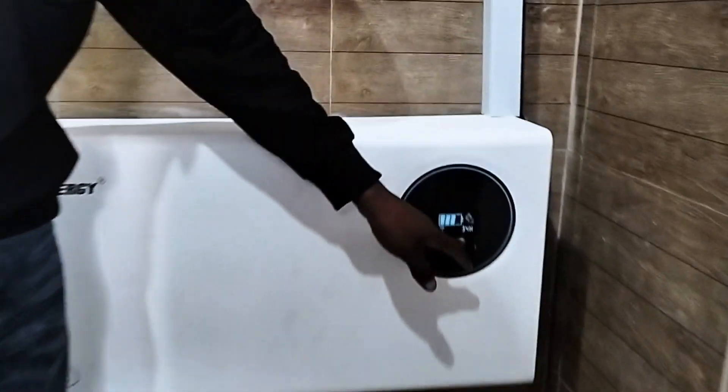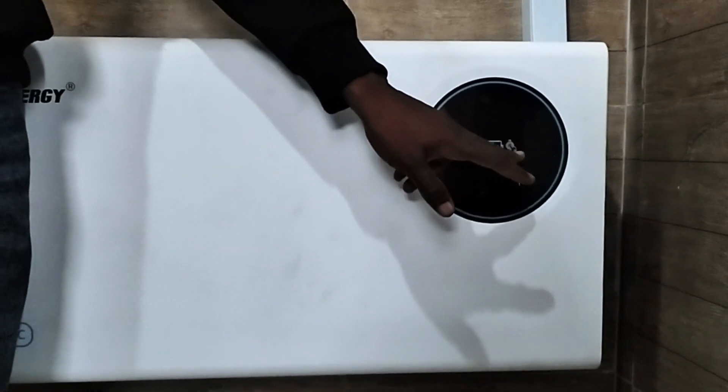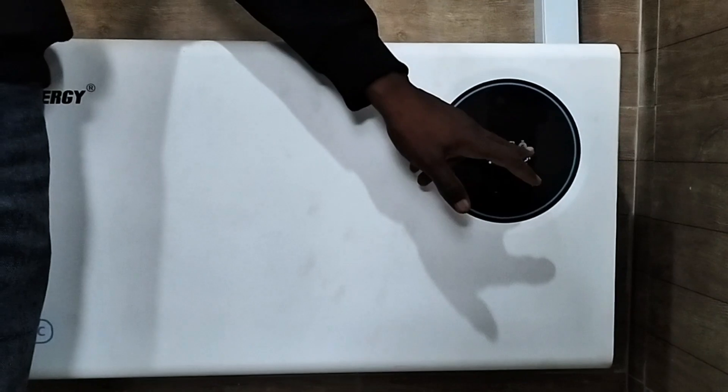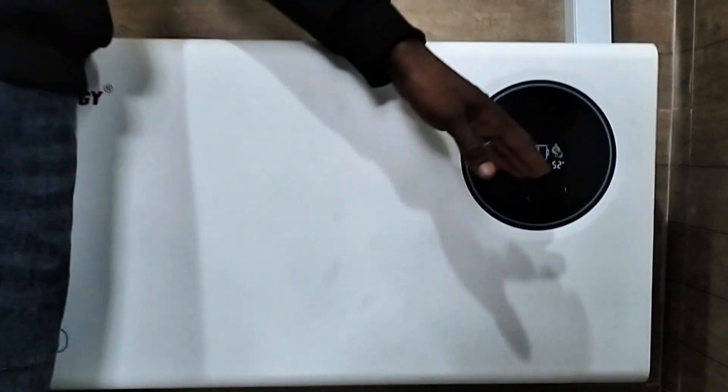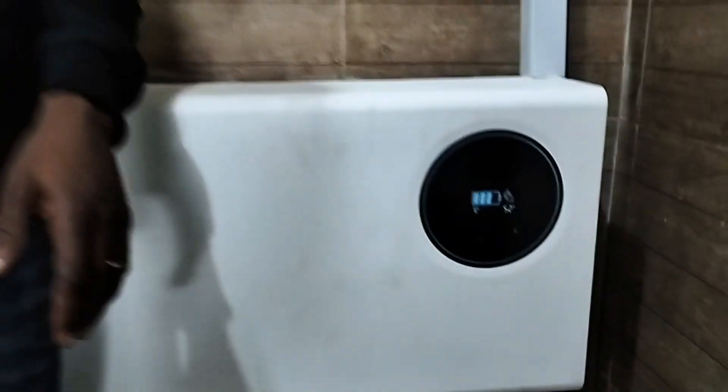So if you are draining 400 watts from this 10 kilowatt hour lithium battery, it will take 34 hours to drain it out completely. The reason it's showing 34 hours is because the battery is not at 100% — it's at about 52%. So to drain out this 52%, it will take 34 hours. That means if you have up to 100% and you are consuming 400 watts, it will take about 68 hours or even 66 hours to drain out the battery bank.